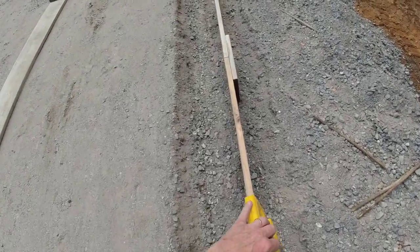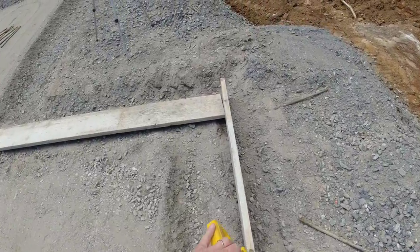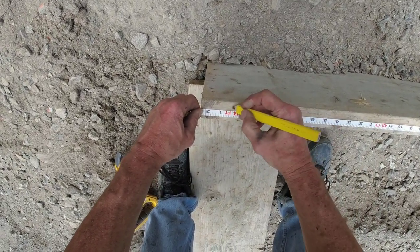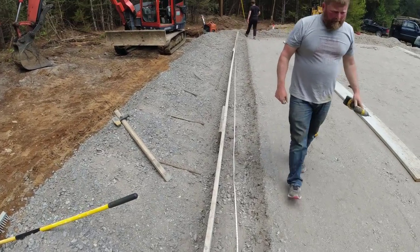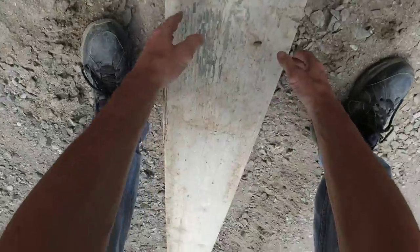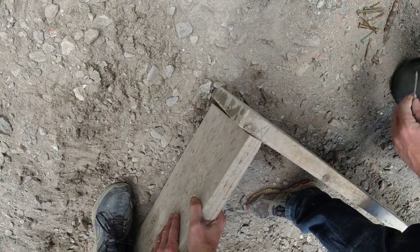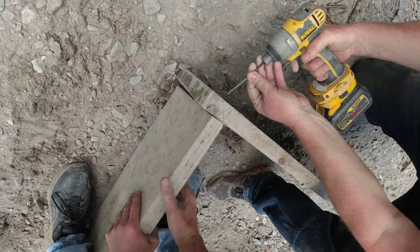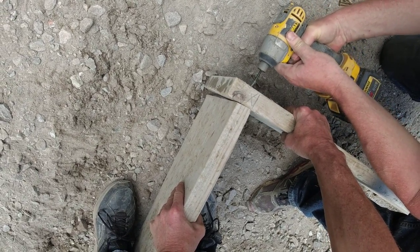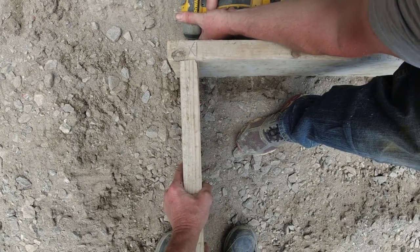That's a 44-foot form right there. When we form up a house slab or a garage slab, we like to have our forms just a little bit longer than the actual dimensions - that way when we go to screw the corners together it gives us something to screw into. I've got 44 feet two and a half inches, which gives me plenty of room to butt my other board into that one and get it screwed in. The gravel this guy used was like a one-inch-minus gravel - it packed really well, it's going to be a really good sub base. There was a lot of ledge under this area, which is why they didn't put in any foundation or frost wall. They decided to go with a house slab. A lot of people build on slabs here in Maine - they just want a one-level house, simple.